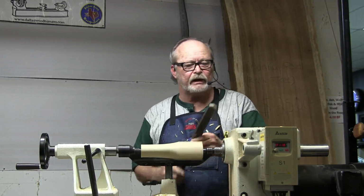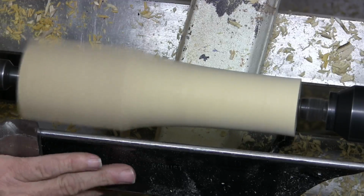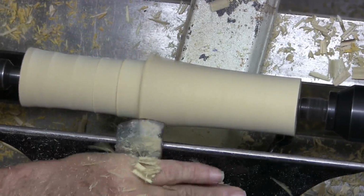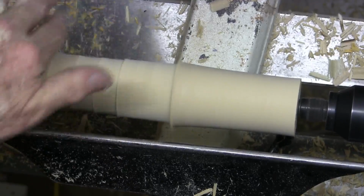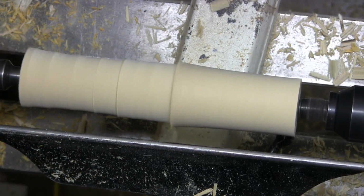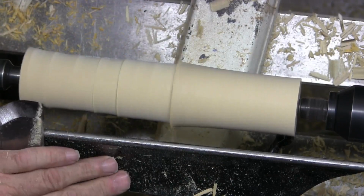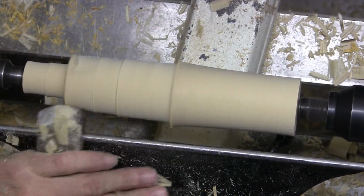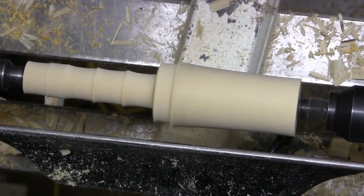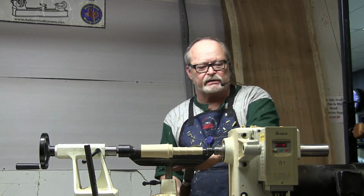This is peeling, totally different animal. Handle is way down. I've got the tool almost vertical, hand on top. Now, it's not going to be as nice a surface, but there's zero chip out. It's fuzzy. It's a pencil sharpener cut. See, it looks like something that came out of a pencil sharpener. It's a roughing cut, but for taking off the corners. You can also use it to remove stock very rapidly. Okay? That's a peeling cut. It's a wasting cut. But often we use it for removing the corners, but it is flat on the rest. It's like a big parting tool.